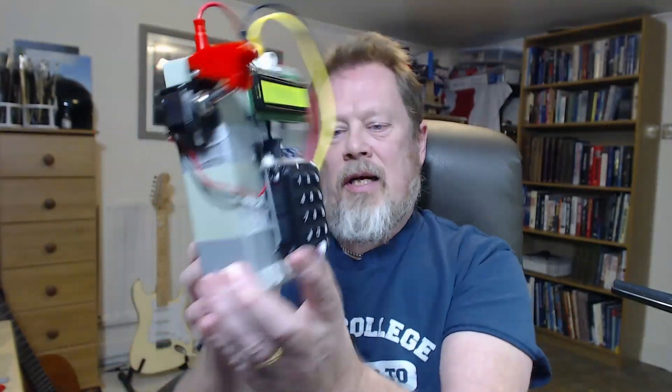There are a few other things as well. You can see it's got a backlight — the display is illuminated. If you plug it in via USB port, there's a little Windows application I wrote where you can set the time. If you've got daylight savings time, like here in the UK where the clocks go forward in spring, you can plug this into your computer, fire up the little app, and program what the current time is. As a bedside clock the backlight is quite bright — at the moment it's only on about 20% brightness. In the app I also coded it so that the brightness changes: at night it will switch to a lower brightness, and in the morning it can switch to a higher brightness.